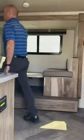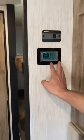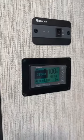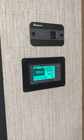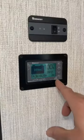We come in here, and you can see on the battery monitor we're only putting two watts in. Well really we have a lot more sun than that. That's not how much watts we're putting in — we're putting in more than that, but the batteries are full, so it's only taking as it needs.